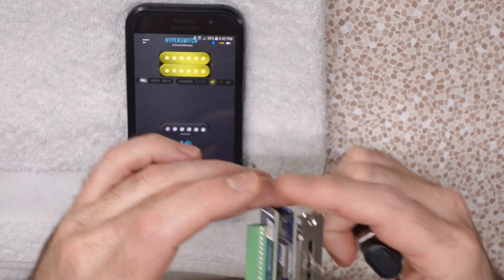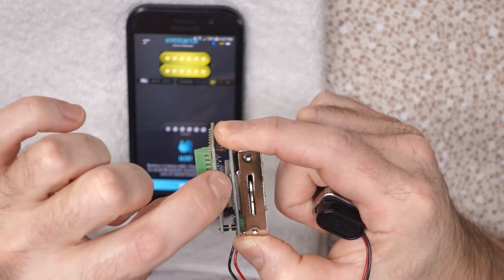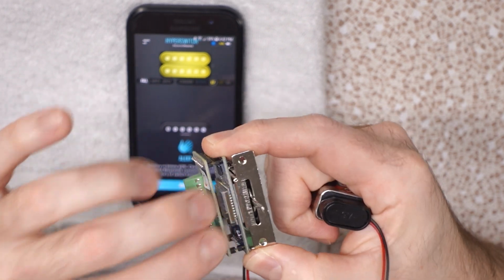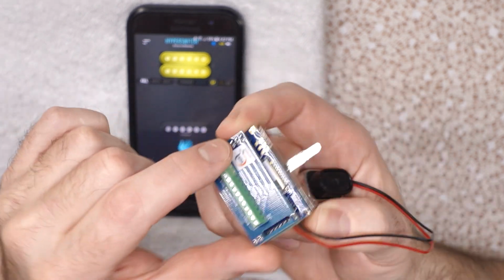And I'm imagining they probably took a jelly bean component. They didn't custom make this for this switch. This is probably an existing mixer DAW Bluetooth interface that exists already, and it's simply a little mini mixer board, and it's taking the pickups, and instead of having knobs and gain knobs, that's all preset, and it's just taking the different channels, mixing them, routing them to the output. Mixers typically don't have features that allow you to wire two channels in series, so that sucks, because that is a setting that I really like, and if Seymour Duncan can fix that in software, I would appreciate it.